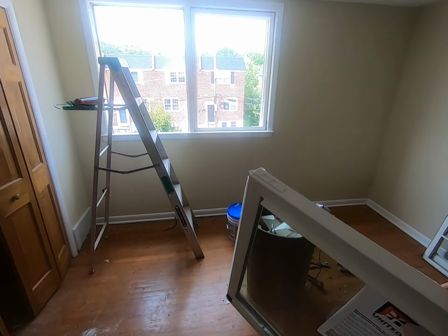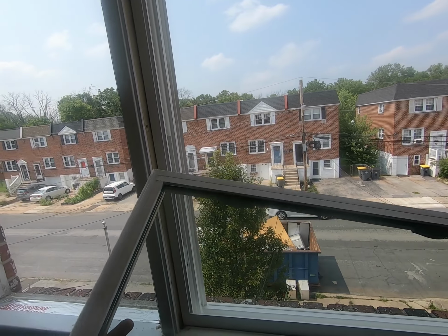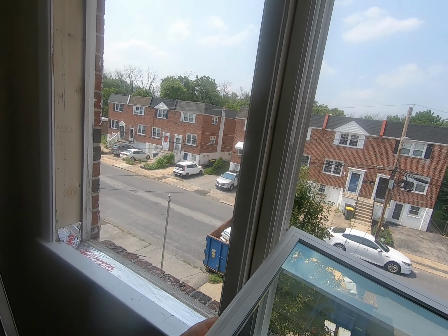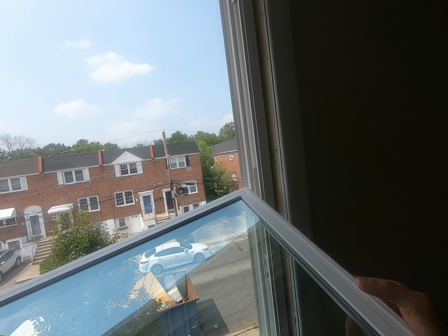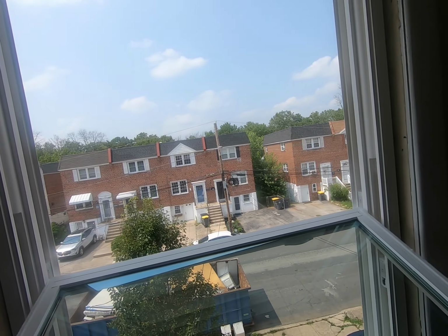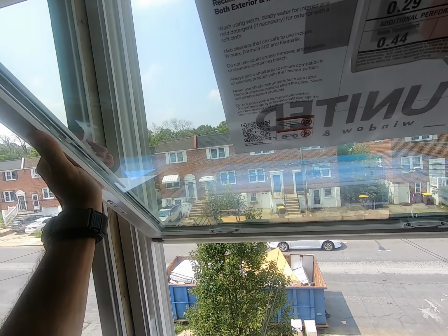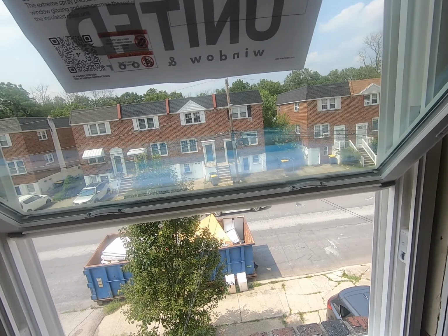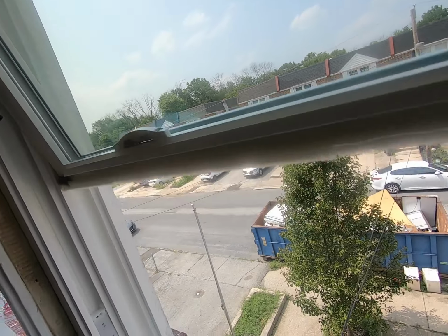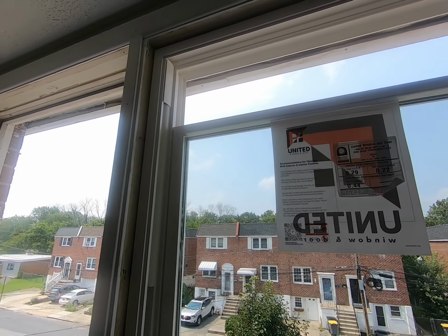All right, you guys, time to put the sashes back in. Grab the back sash and we're gonna reverse what we did. So I'm gonna go in and I'm gonna align it with the other one. We're gonna need to push up on this one to make them level. You see that? And you tilt up. You're gonna hear two click sounds. If you do, that means we're good. There you go. And you could see at the bottom, we're right in. Push it in, and you're done.